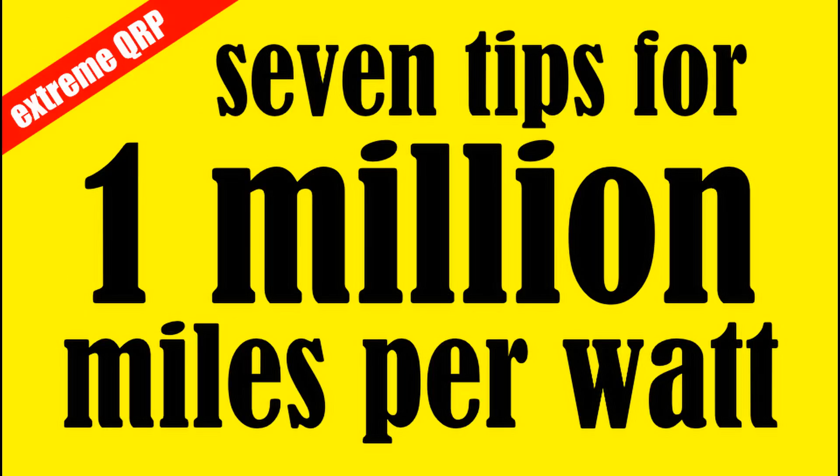You're probably not going to get all this right first time. You might want to start with, say, five watts, and then if you succeed in making contacts, go down lower and lower. But if you really want achievement, then why not start with the milliwatts and try to make as many calls as you can to various stations. In the majority of times they will not hear you, but you might get one or two stations that can hear you if you're running, say, 100 milliwatts, maybe even 10 milliwatts first up, and that can give you a real buzz. You can also always increase the power if they have difficulty — you're then not getting as much miles per watt, but it's still quite a good QRP contact.